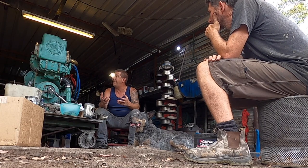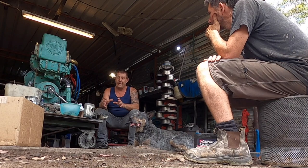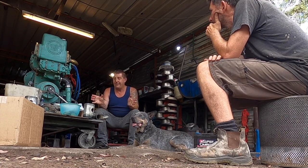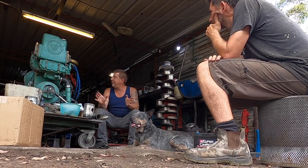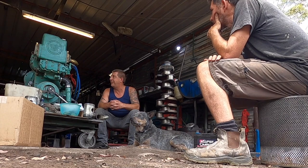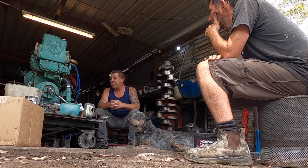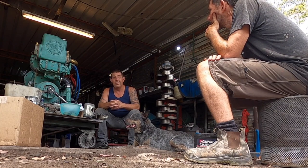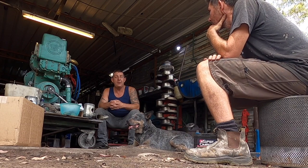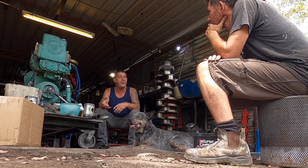But just to make these turbos would be just changing the pistons. Pistons and liners, change when it's set, so it's just starting from scratch. And then everything else pretty much the same. Just the turbo, blower clearances, and lower compression pistons. Lower compression, yeah. And they work really well on these. It makes it burn cleaner, a bit more oxygen. So it cleans up a little bit of unburned fuel, and you get a little bit better acceleration out of it. Okay.